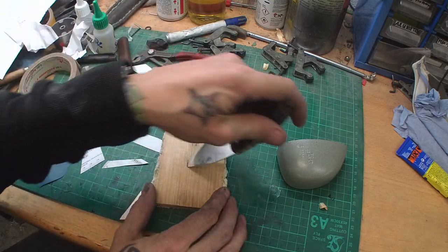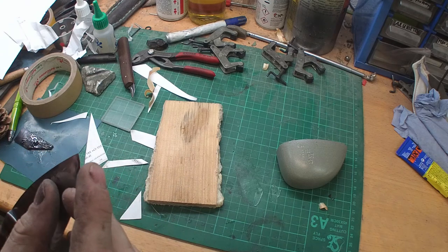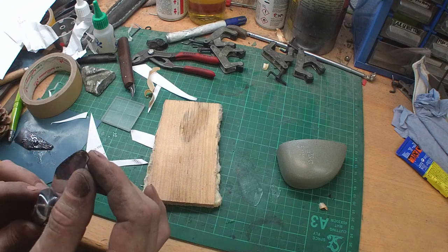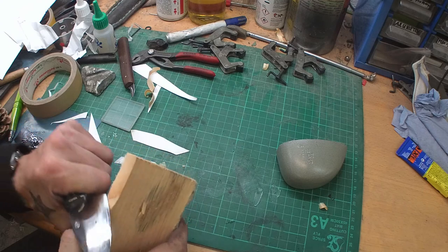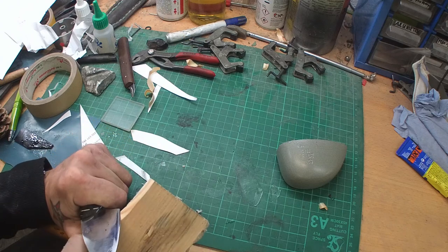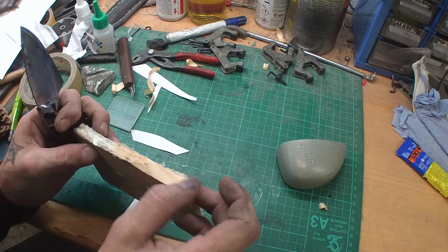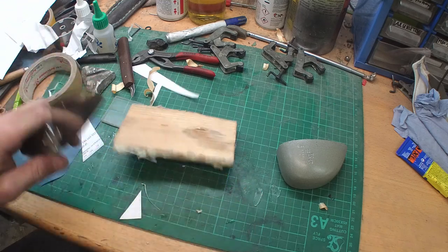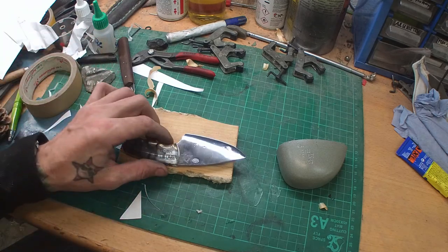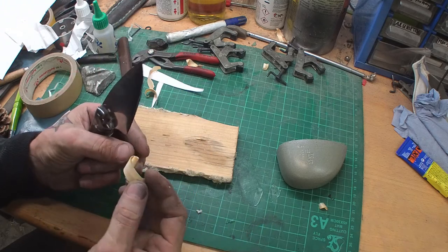Pretty good. For this small piece, I have to say, that's pretty good, pretty impressive. So, I mean, it's really soft wood, just some pine wood, so not very hard stuff. But as you see, the surface of the cut is very clean, very smooth. That's because of the polish of the blade. The more you polish your blade, or the more you polish your cutting edge, the more beautiful the surface of the cut piece will be.